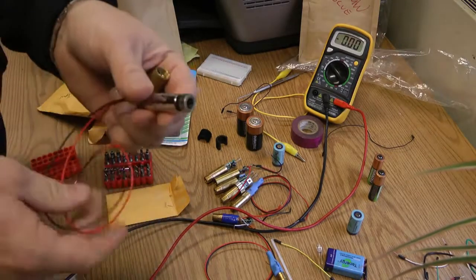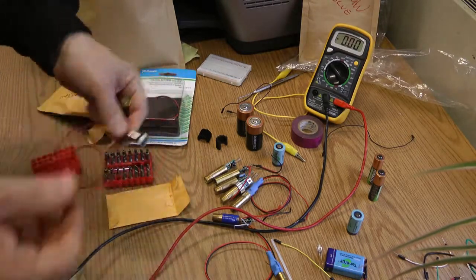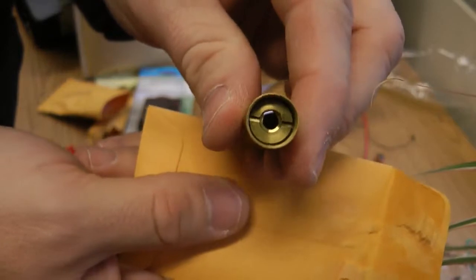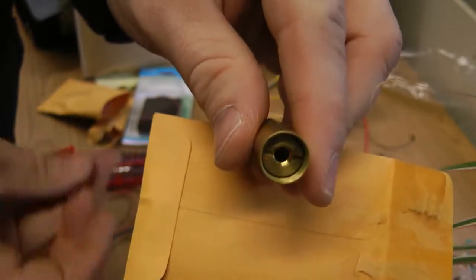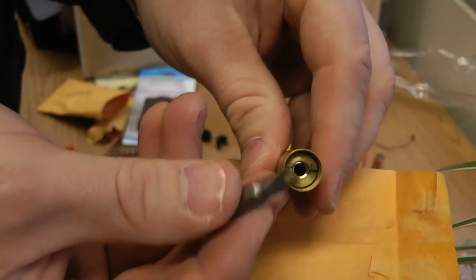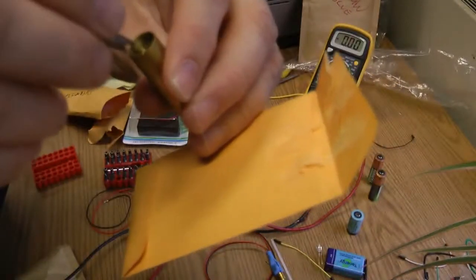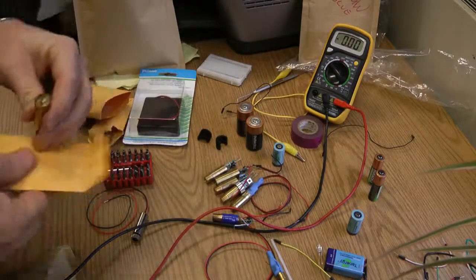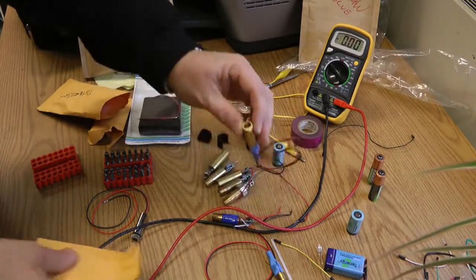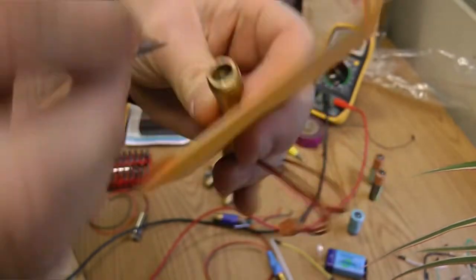This is a 200 milliwatt — a rather burnt-out one. A lot of these green lasers have a special socket inside and you can't use a flat-head screwdriver on that; you need a security bit. If you use a flat-head it'll scuff up your lens. So generally we use a security bit set — this bit size will work for this one and it'll adjust the lens.